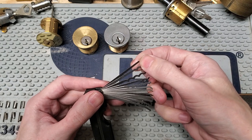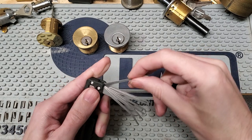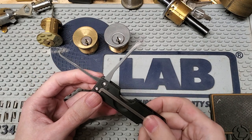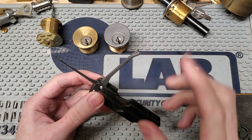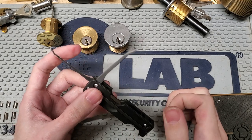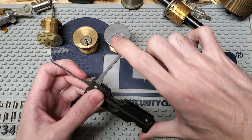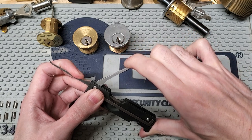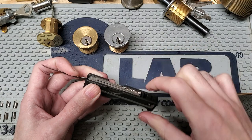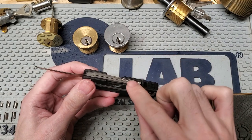And then you get a flat probe. I like the flat-nosed short hook, so we're going to fold that out and pack everything back together. This is the bit where you have to be careful, because that spring is very, very strong and you will give yourself an ouch if you're not careful. Take one hand and brace the pick in the open position, then use a pinching motion with thumb and forefinger to bring the pack of blades back in. Around 45 degrees, that spring will take over and snap them all closed very stiffly — so keep your hand clear.